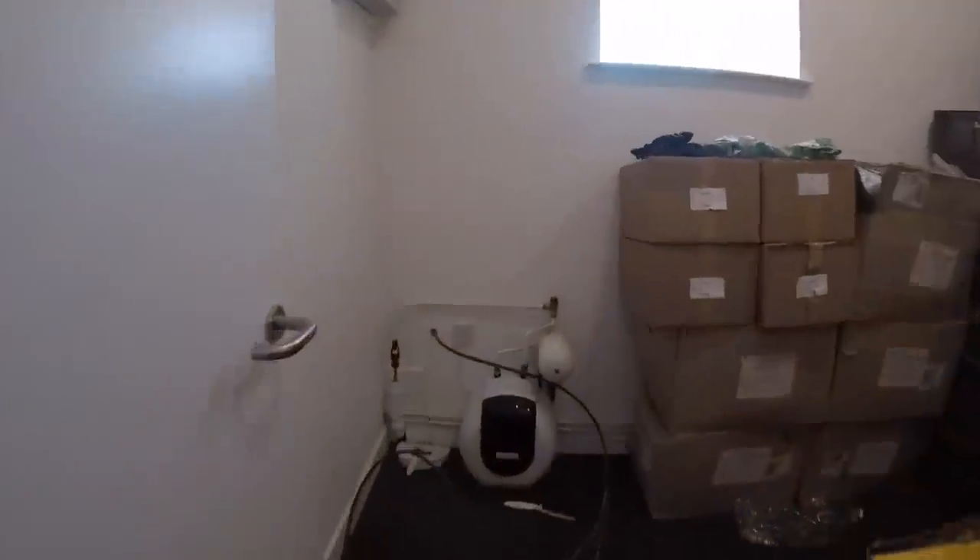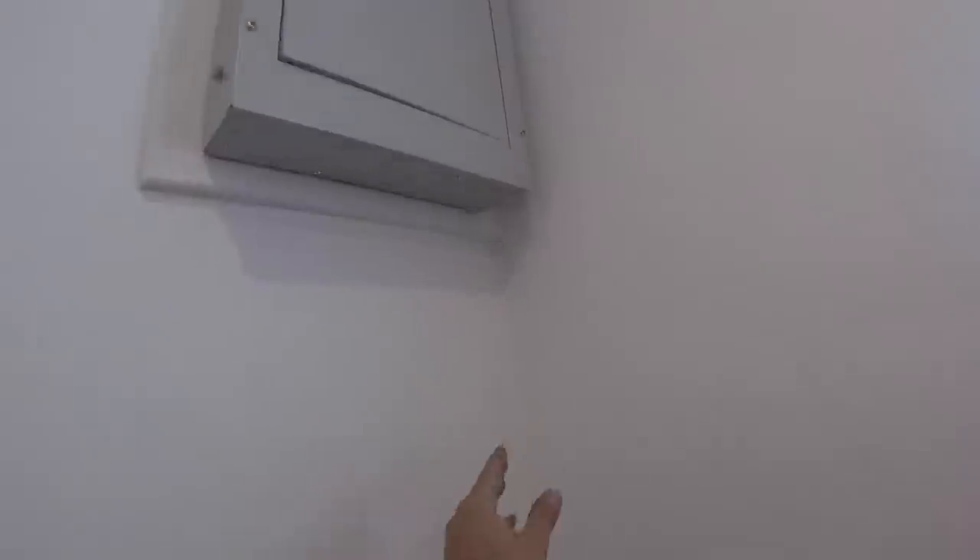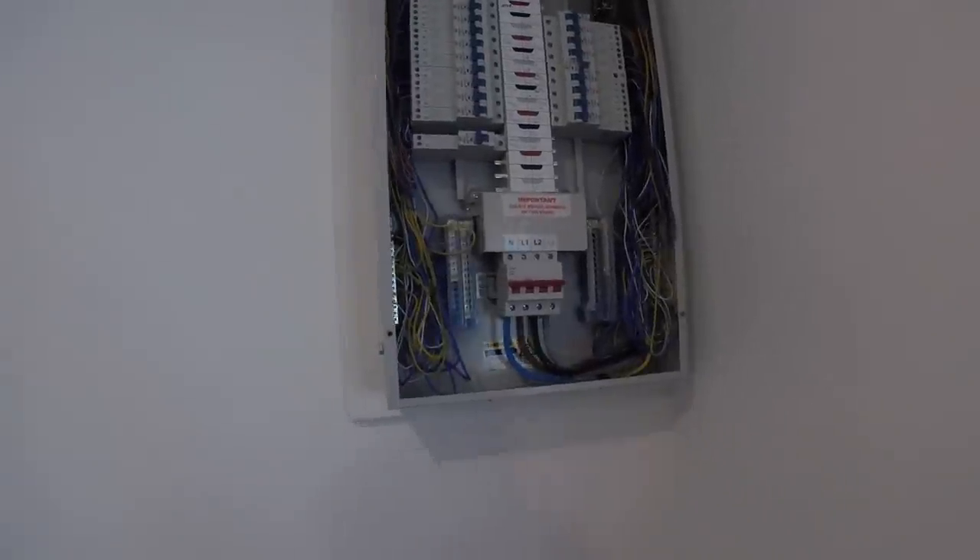There's my cable through the wall. I'm going to come across there, up, and do a little kick up into the board, so I'll be able to pick up the joist for my cleats. I'll put a bit of white silicone or filler around there to seal it up, and then we're good to go.